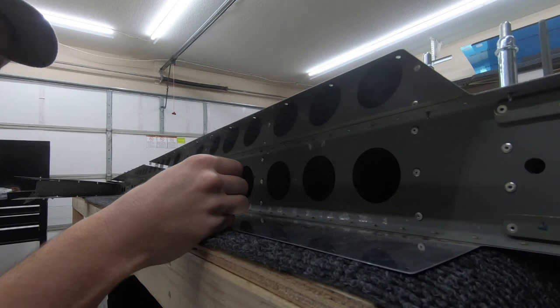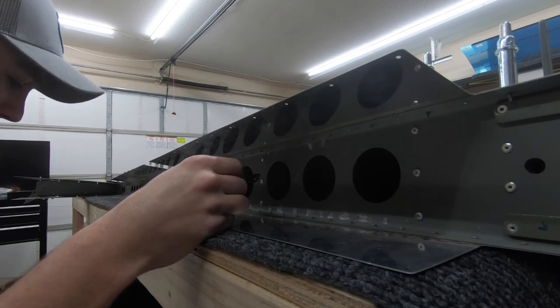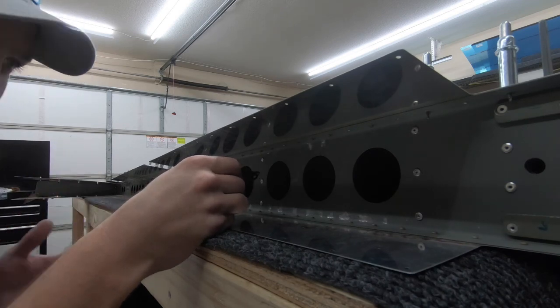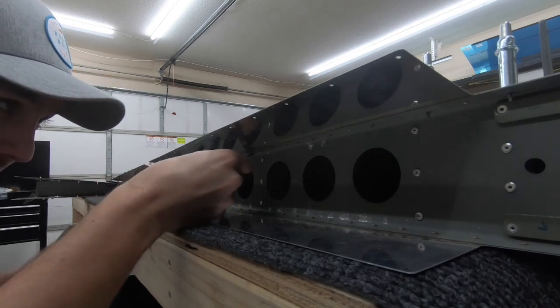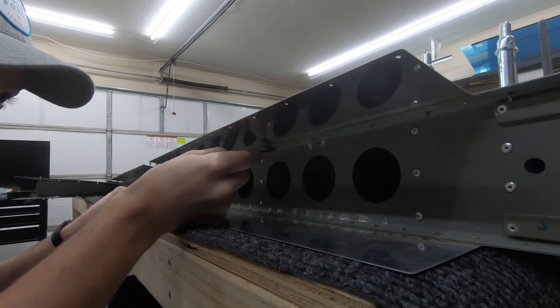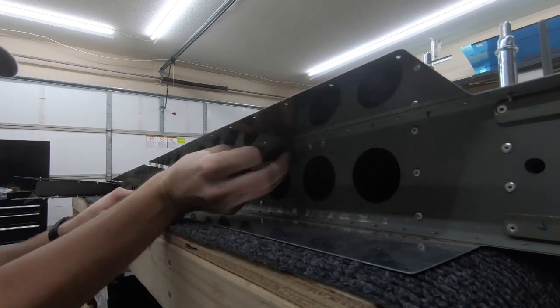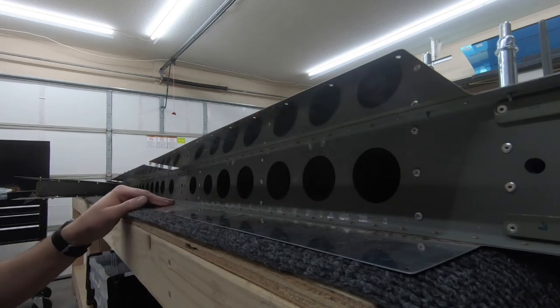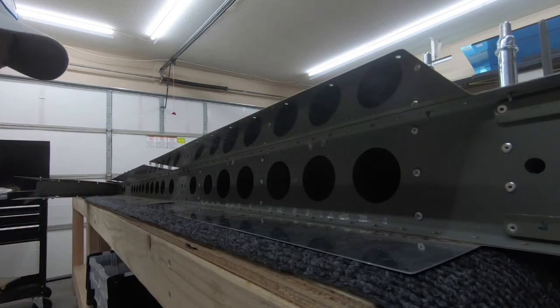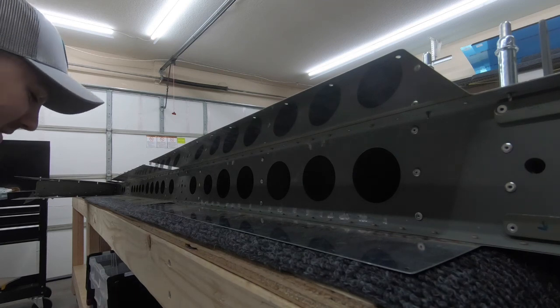They all end up very consistent if you listen to that sound of the gun dying off with the amount of air pressure in the line. So it made this way more enjoyable. I hated bucking the last few sections. Now I can see how, if you have the gun tuned in and know what you're doing, they all end up really, really consistent. None of them go too deep, and they all meet the depth requirement. So: tune in your gun, get it taped up so you don't scuff everything — those are my two trick tips of the day.